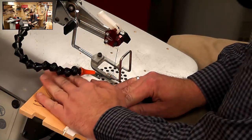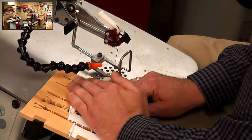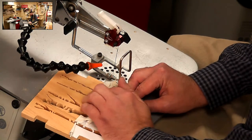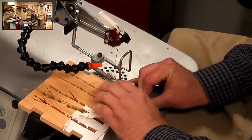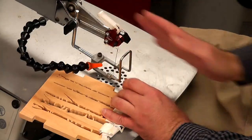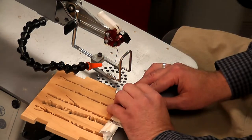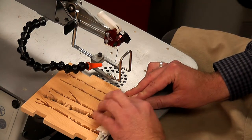Okay, so another question. Yeah, got a question from Maria. Any tips on cutting long straight lines and also perfect circles? So long straight lines is fairly, well, I say it's fairly easy. You can get wider blades. You get the kind of hook tooth blades. They have, as the name implies, quite a large hooked tooth. Now, even if you got a fence on this and you were running your piece of timber, these blades have got too much flex on them, really, to cut straight lines.